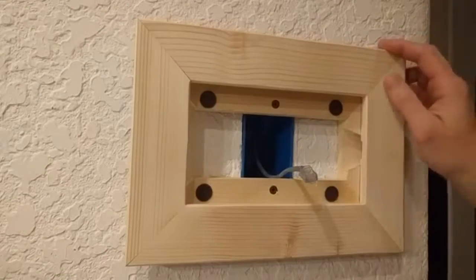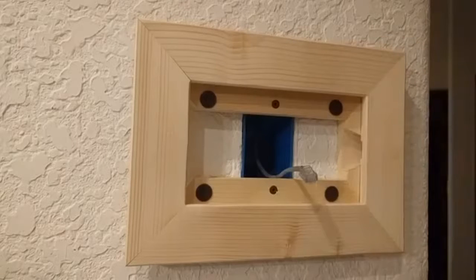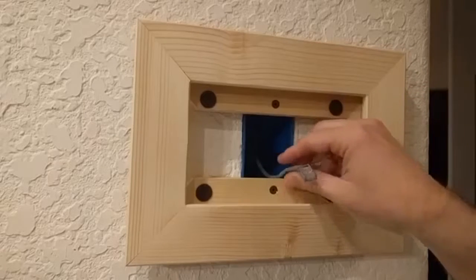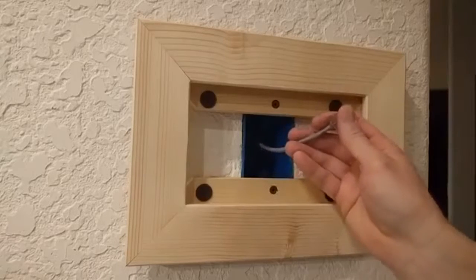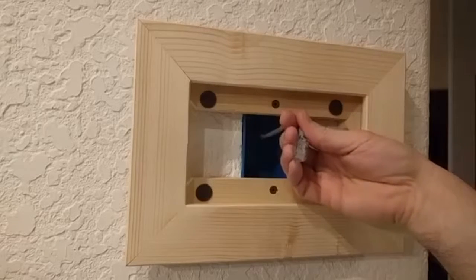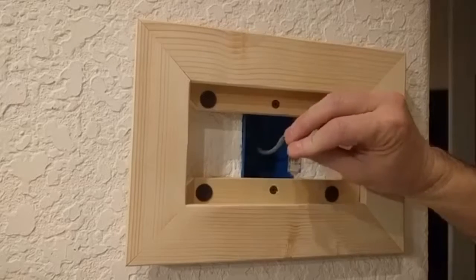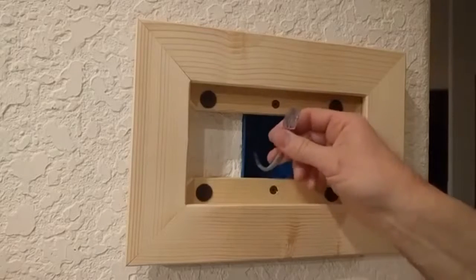Here we have the tablet end. We're going to go ahead and install the power splitter at our tablet. We've got a single gang box on the wall, our tablet wall mount, and our CAT5E wire run with an RJ45 connector on the end. One thing to mention about the wiring and the connectors: if you do your own plugs here, just make sure you do the exact same wiring configuration on this side of the plug as on the other end at the power side — if you do that, you should be good.